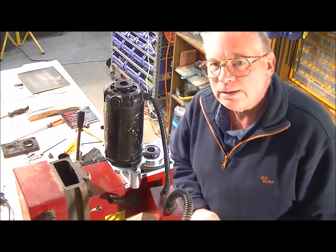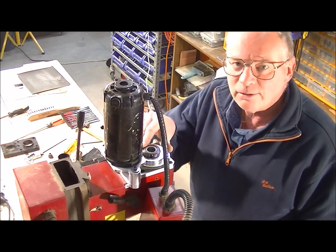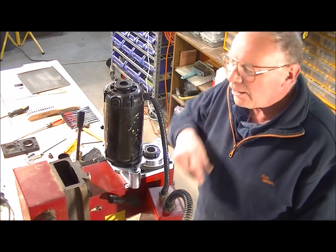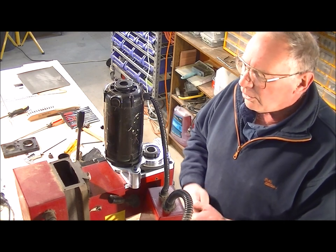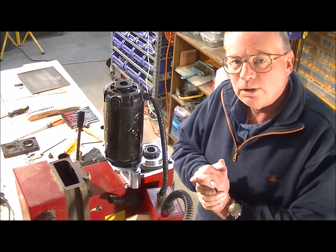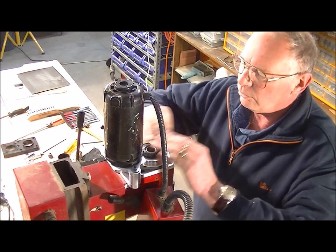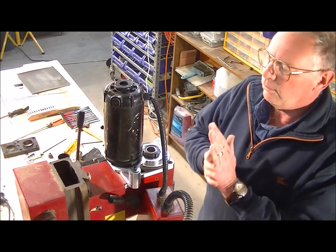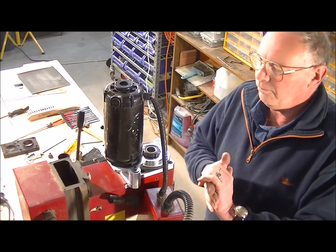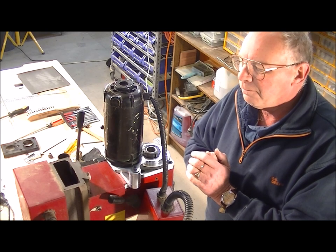I did fit this up before coming on camera to make sure it all went together. There was just a little bit of fettling here and there, and I did have to re-bore the centre of the lathe pulley — I'll be honest with you — because it was just too tight to fit on that shaft. What I'm going to do to finish is provide an aluminium shield or guard to go on here. We haven't decided on a company name or emblem yet, but it'll be an aluminium cover.